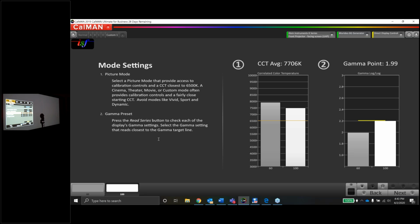It's an analog panel. It goes through basically a shift with time, and this shift typically happens somewhere between about 100 and 200 hours. What happens is the factory gamma goes really wonky, and that's why you're seeing such a big divergence. If you were to pick 6500 or a certain gamma, you'll see it more with gamma than you will with grayscale.